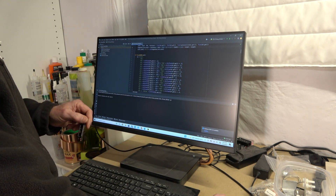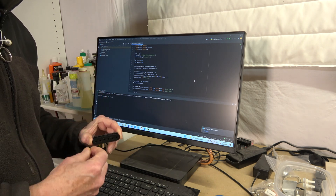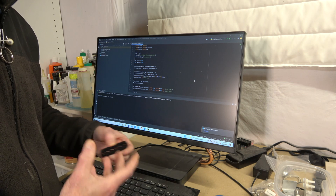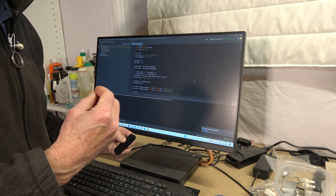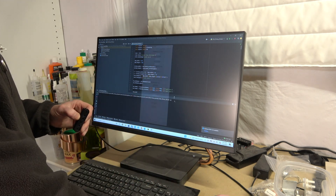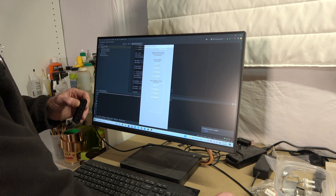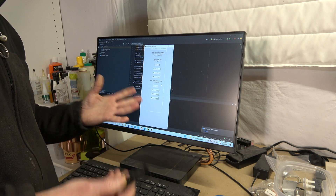And when talking with a lot of other pickup makers, they tend to rarely use resistance as a measure of anything with regards to pickups. The only thing I ever really use resistance for is to make sure that the coil is viable. So I'm thinking about deleting that whole section from the software. All you would do is input what you want for your turn count, and the only thing that does is tell you how many minutes it's going to take to wind the coil when you click calculate winding time — it'll also help determine the length of the G-code written when you select one of the scatter patterns. I'm just not convinced that calculating resistance is the right way to go, and I think a lot of pickup makers out there will agree with me.